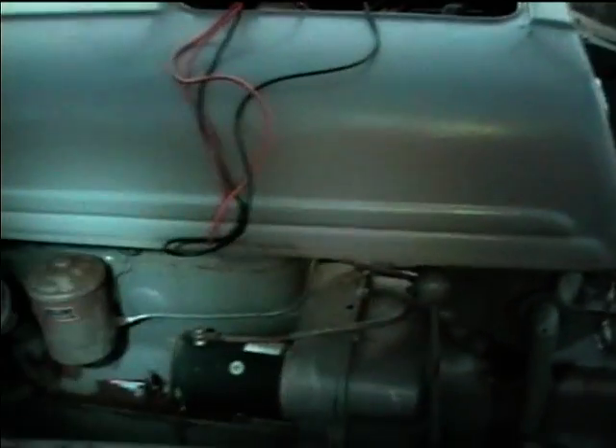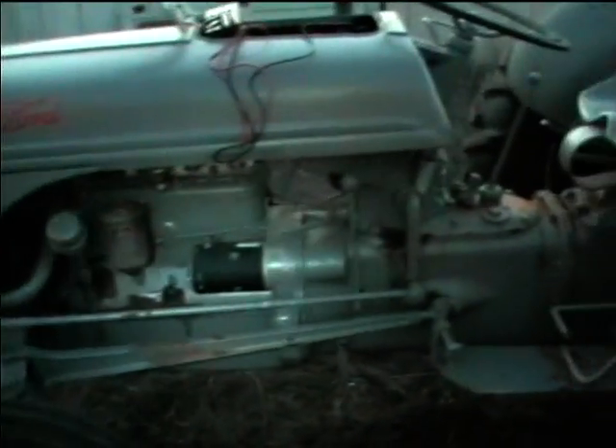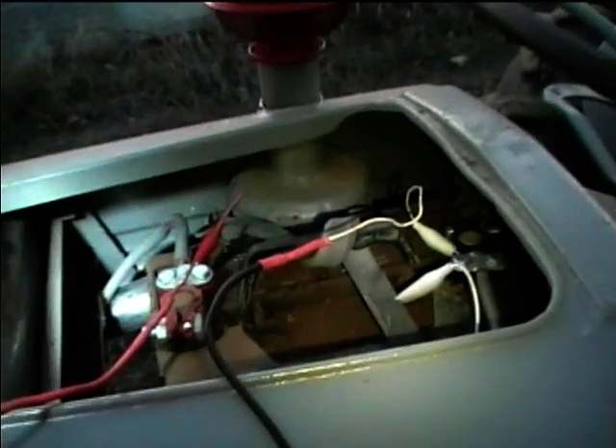Here's the 1940 Ford tractor. The tractor has really been doing yeoman service in keeping the fields mowed, but it did have a failure about a week ago and I think I figured out what the problem is. The battery had ended up going completely dead. I had to jump start it, and then as the tractor drove it would lose power after about 45 minutes, and I found that the alternator was not charging the battery.